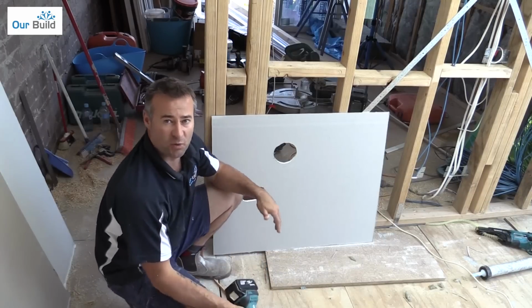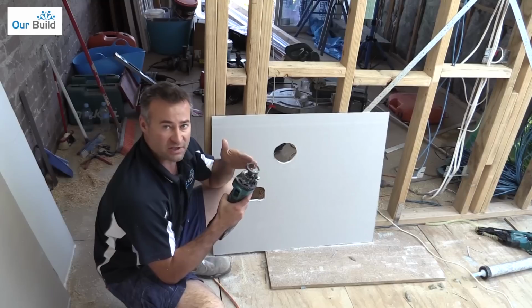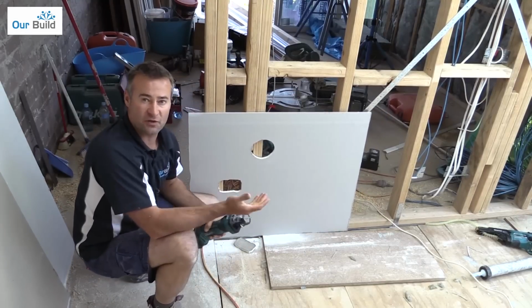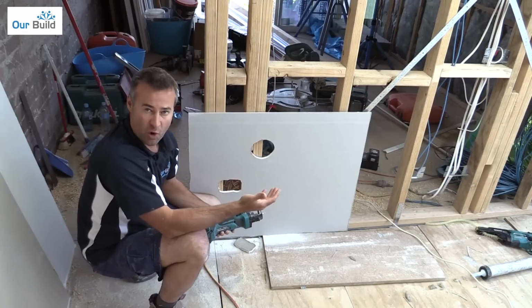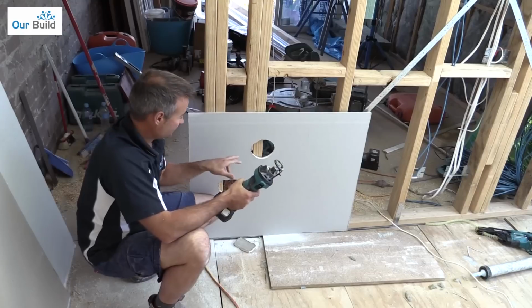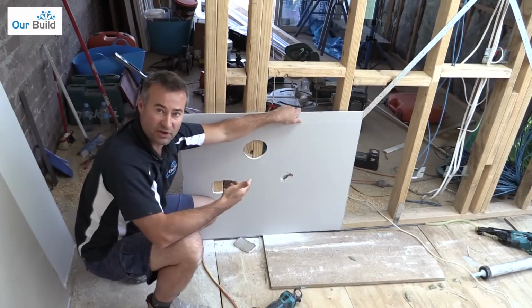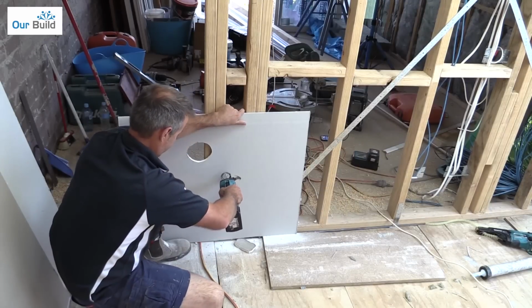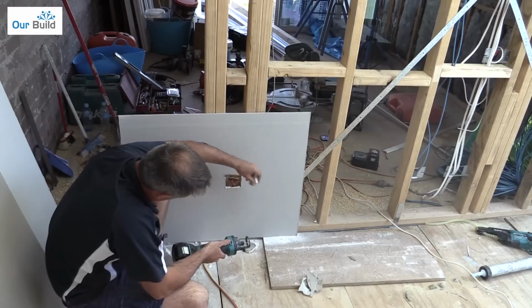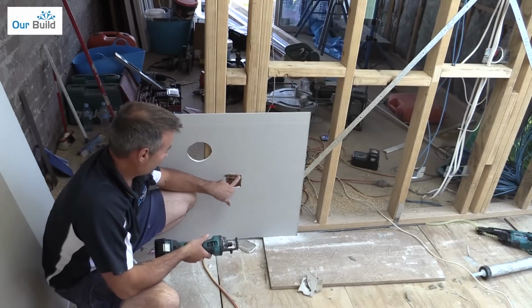Another one would be if this is up on the ceiling and you've got to do a patch, like say there's been a hole punched in the wall. The benefit I could see of this is if you just set this at the 10 mil and you've got this against your wall and you don't know, say it's an existing household, if there's wires or anything behind it, just set it to that 10 mil depth and just use that to then cut around. Like say there's a hole like that, someone's punched a hole in the wall, you need to go patch it, you need to go trim it. That's a pretty rough freehand version, but yeah, you can just use that to trim around, make the hole bigger so you can do your patch.